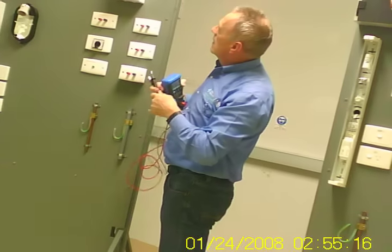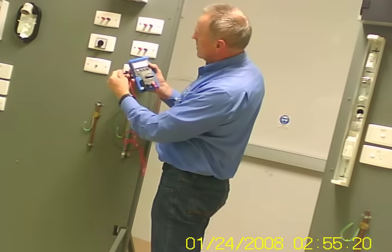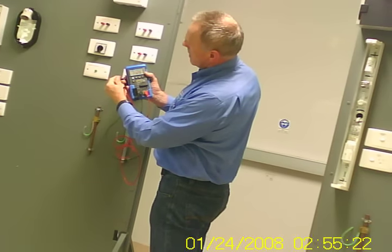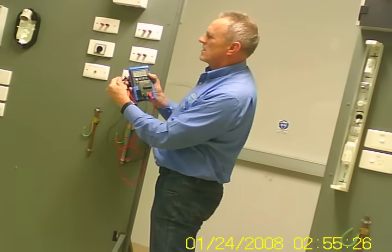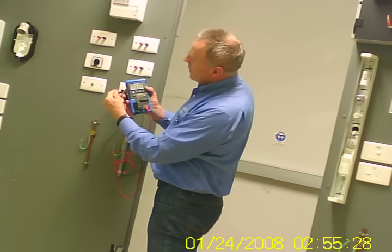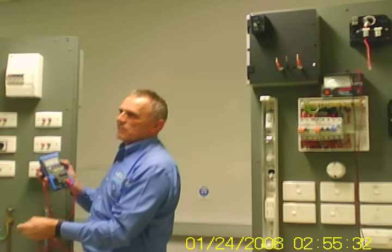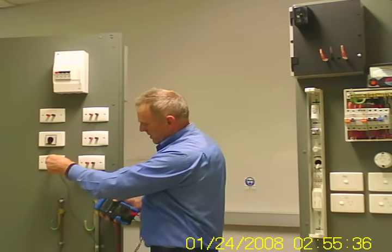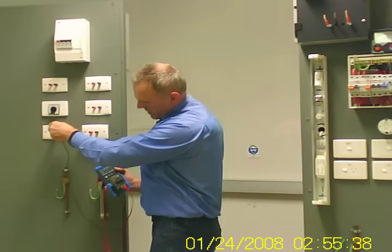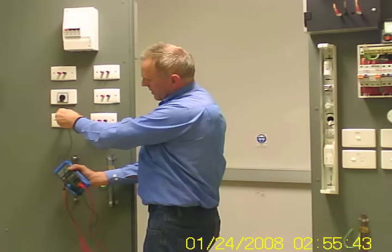All right, I'll just go one more step. It's a total break. All circuits are in. Look what we have on the installation now. 11 volts, from 26 to 11. You know, that's quite a bit. So if we have 11.3, what should we have on the earthing system? About 15, 16? Yeah. Let's just see. Yeah, about 15.4, anywhere on the earthing system.